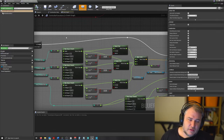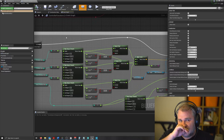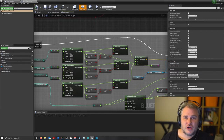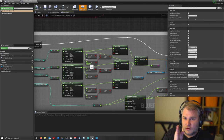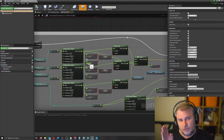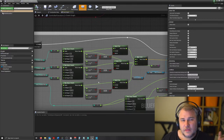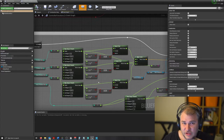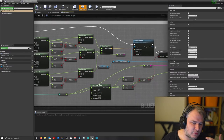One of the previous issues with the controllers is that it would constantly flicker things like zoom or slight movements, X, Y, Z movements and rotations and things like that. So we've tried to put limiters. If it's above 1 or below negative 1, then change based on those restrictors. That should mitigate the constant subtle flickering of the analog controls that can get read from the Arduino or the ESP32. Some of these still go beyond that value, so there's a little bit of room to tweak. That could be to do with some of the soldering, the connections, or things like heat. There's other things in there, but in essence we've got some clampers for the main movements.